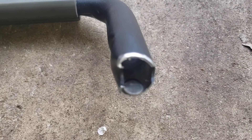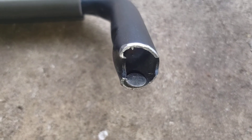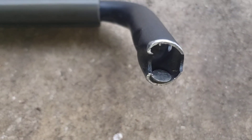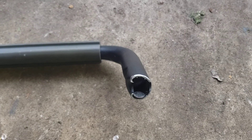The other side's fine, but yeah, that's right where your bail brake's at. And I imagine that because that tab is stuck in there, when the consumer was pressing on the bail brake all the time, that was just kind of forcing it out. So I'm going to send a picture to Toro and see what they say.